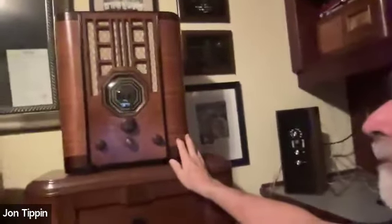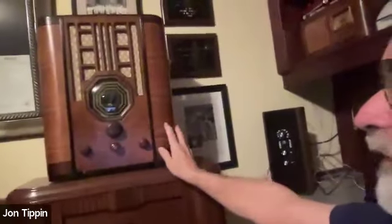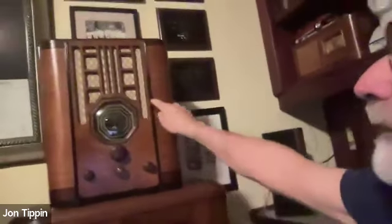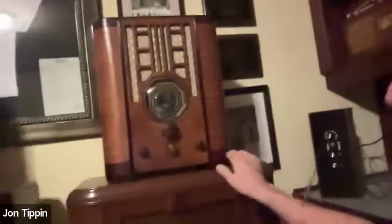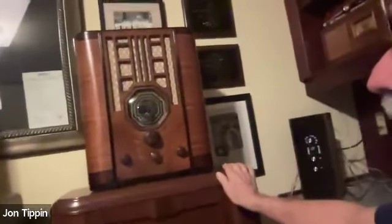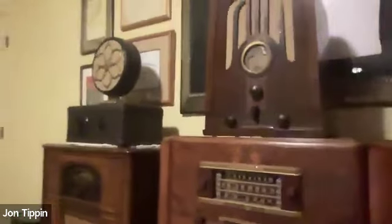I had to refinish this entirely. I think this is Sapelli or something like that on this walnut here, and that was mostly done by stripping it down and using more of a natural stain. I used black lacquer paint in these places, and these darker brown areas were done with toner, and then spray lacquer over the whole thing, and it's nice. The only issue is this is not the right knob. One of these days I'll have to find the right knob. It's supposed to be a kind of plunger thing, like on the 620. So anyhow,